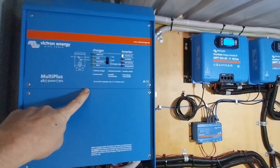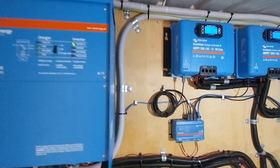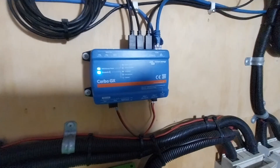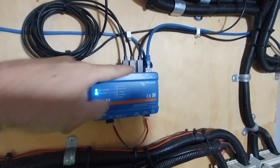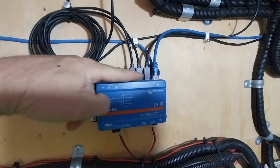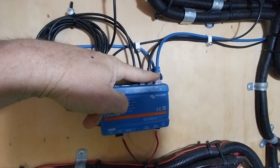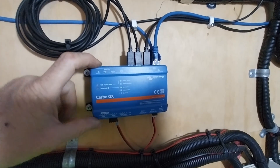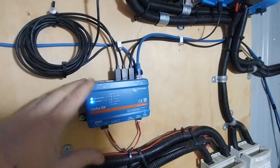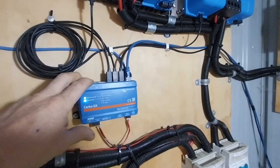Like our little system, we have monitoring devices — but in this system we have more than one. We've got a shunt down here monitoring the current through the batteries, and a monitoring system plugged into each of the components — the charge controllers, the shunt, and the inverter — and that talks to a modem which uploads everything to a portal I can view through the app. So we still have a monitoring system, it's just more advanced.